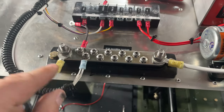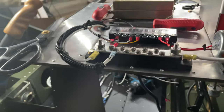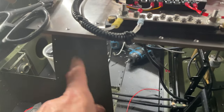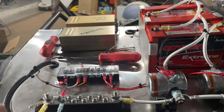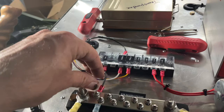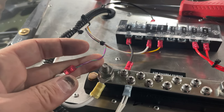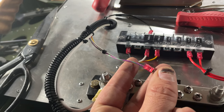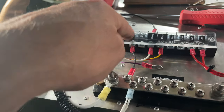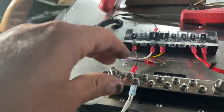The ECU is connected to that, and then I have a line coming off here with ten gauge, which is going to go down through the hole there and go to my 30-amp breaker that I'm going to be using instead of a fuse. From that breaker it's going to go up to everything else on the airframe. Now I do have my 1K resistor here to pull the 12 volt into the tach, but I was a little confused on where this goes. I'm going to put a question in — this comes from the ECU and it's labeled as tach. Do I put that on the side where that pickup for the resistor is, and then from that side it goes to my EIS system?